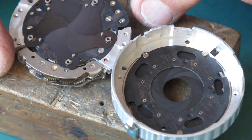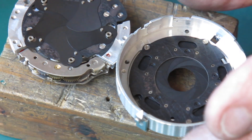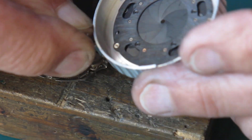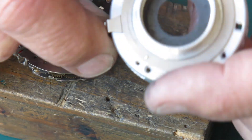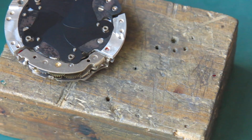Here's the mechanism plate with the shutter blades present. They look a little bit oily — there's a bit of a line around that shutter blade there. And here's the diaphragm in the case itself, and those blades are certainly a bit oily. Nothing terrible. This is a little bit stiff to move, but nothing particularly bad. It'll certainly benefit from the service.